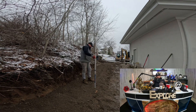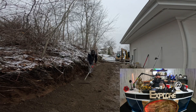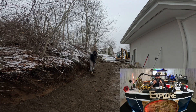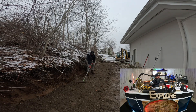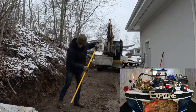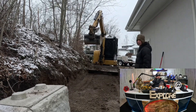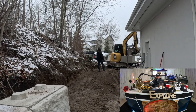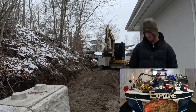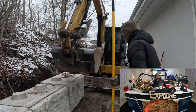As we can see in the time-lapse, we're just carving out the face and digging out the back side of the wall so we have plenty of room to work in there. Once we get everything graded correctly, you can see after we get everything cut out we put in some gravel — we used crushed concrete for the base, about eight inches thick. Then we get everything graded level, hit it with the laser, compact it, hit it again with the laser, and get everything prepped.